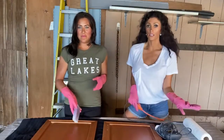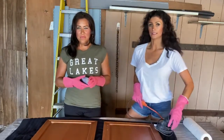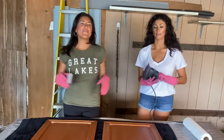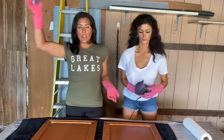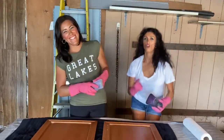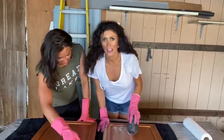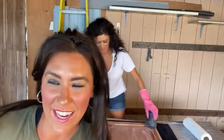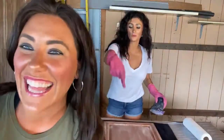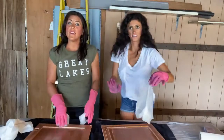After the surface is completely dry, use 220 grit sandpaper and sand the piece. 220 is actually pretty fine — the higher the number, the more gentle; the lower the number, the rougher. Sand with the grain. One host has an electric sander while the other has a sponge. Use a damp rag to clean off all the dust from the sanding.